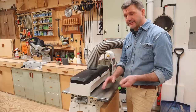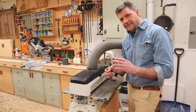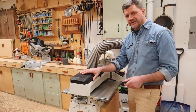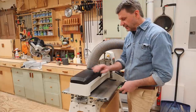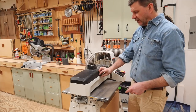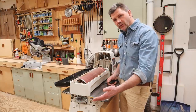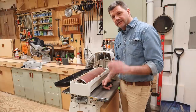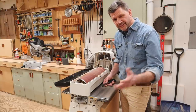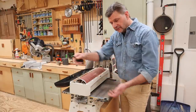Other than that, the machine works really good. This is a small shop — I'm not a production shop, I'm making a few pieces of furniture a year. If you're a weekend woodworker, I think this will do good for you. The price is just about $1,750 to $1,800. It's just one drum and it's an 18 by 36, so if you're going to sand a wider board you'll have to run it through two times. I almost never run anything wider than 13 or 14 inches, but you just run it through one side, flip it, and run it through the other.